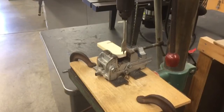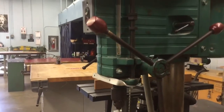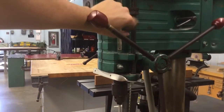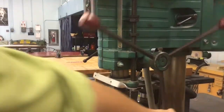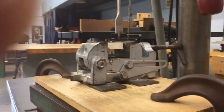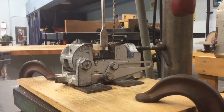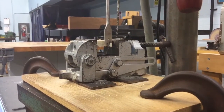We'll zoom out a little bit. On the side of this drill press itself, there's these little spacer things right here on this black bar. We can wind those down to the point where when we take the handles and start to turn them, it'll stop at a certain location. It won't drill the whole way through our project. So I went ahead and adjusted everything, and if we take a look right where the drill bit's coming down through, if I try to lower it, like the spade part, like the bottom part, not the point, only goes about halfway through our project.